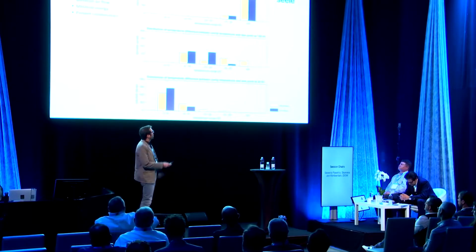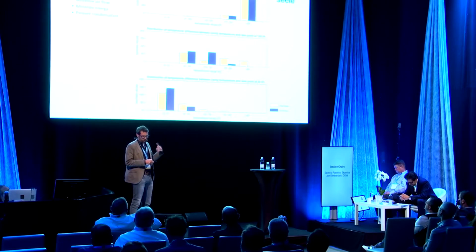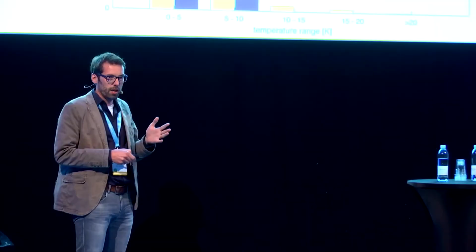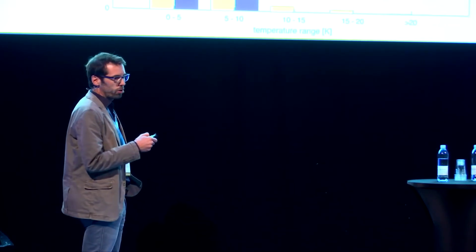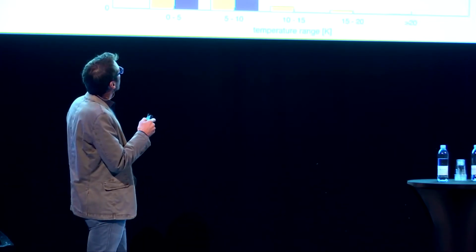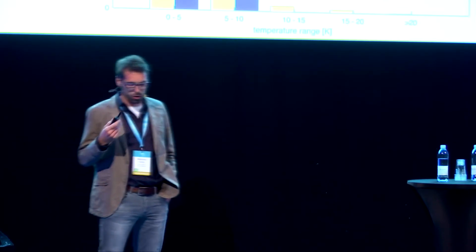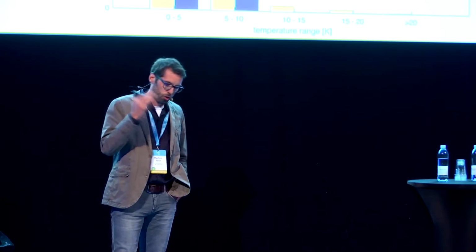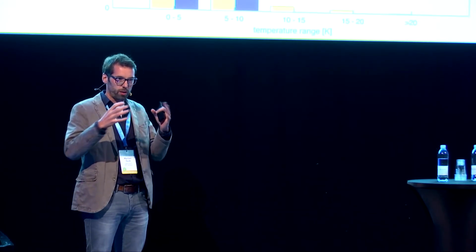We started with the higher values and then went down, of course. The other extreme is 720 liters per hour, shown at the top. There, the temperature difference between dew point and cavity temperature is generally very high, at least 15 Kelvin, up to 20 Kelvin or even more. So there's a very high safety level against any condensation. And then we also tested an intermediate value of 120 liters per hour. There you see a more even distribution, but also there's not a single count below 5 degrees temperature difference. So this gave us quite a confidence to set this airflow between 200 and 300 liters per hour with a certain safety level in the system. But you're also able to adjust the airflow in a certain range. But then you're basically depending on the diameter of the whole system and on the power of the CCF system.